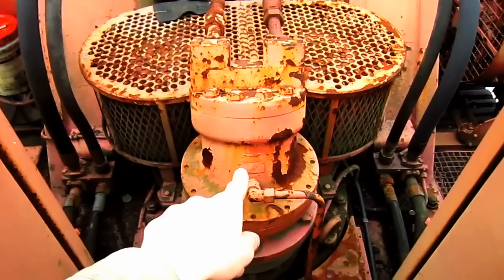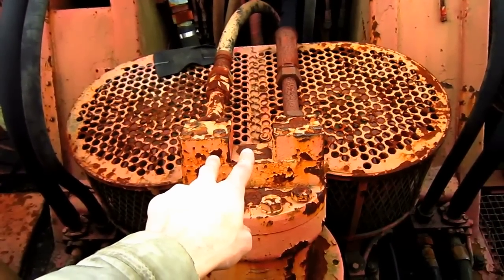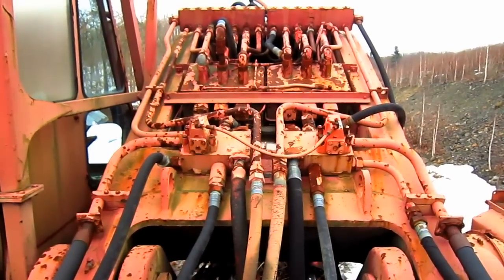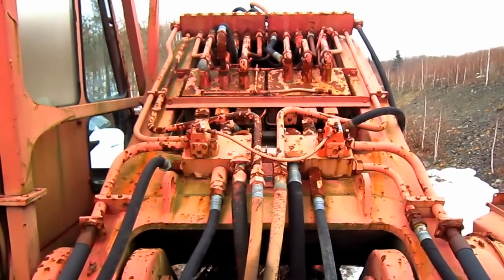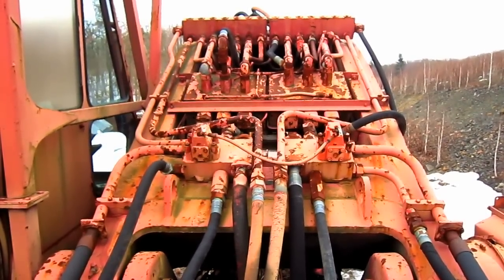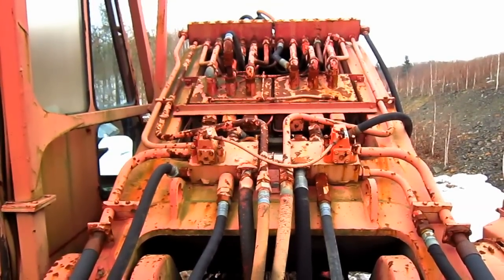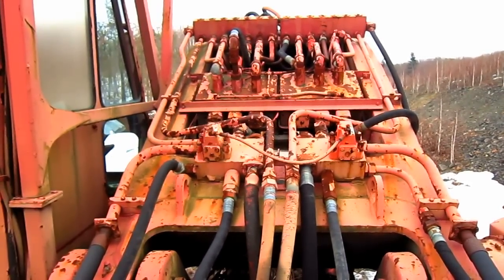Right here you can see the single hydraulic swing motor on the RH-75, and directly ahead of it you can see the two swing drum brakes. The main valve blocks for the front attachment are mounted on the back of the boom. All functions of the attachment feature O&K's automatic double flow system, in which both circuits with four pumps automatically combine their flow when only one movement is actuated by the operator, and automatically divide their flow when multiple movements are actuated. The benefit is that the hydraulic speed for a single attachment function is doubled, which thus fully utilizes hydraulic power.